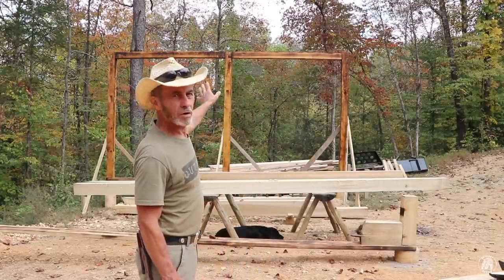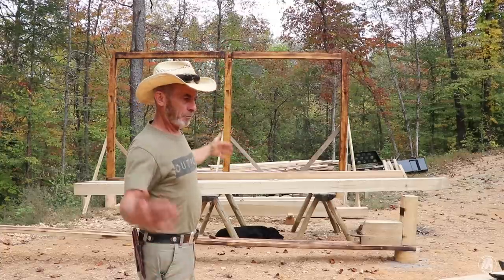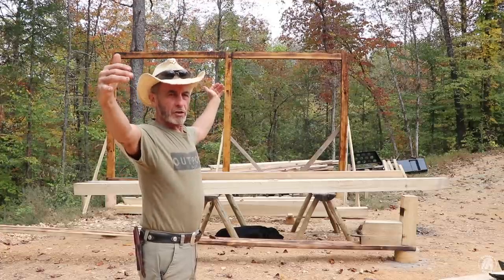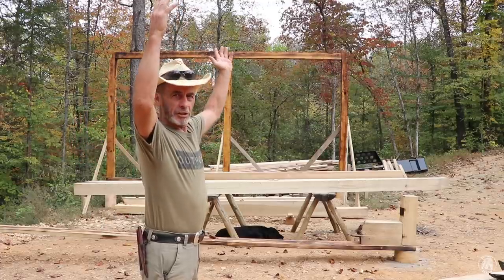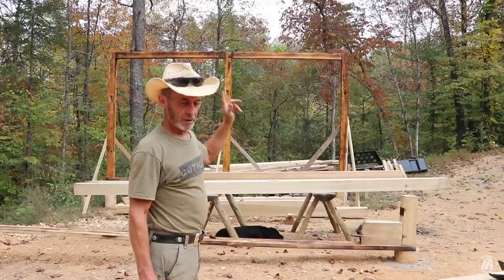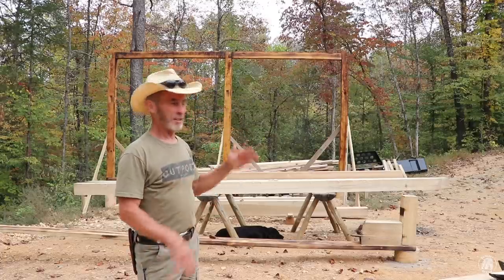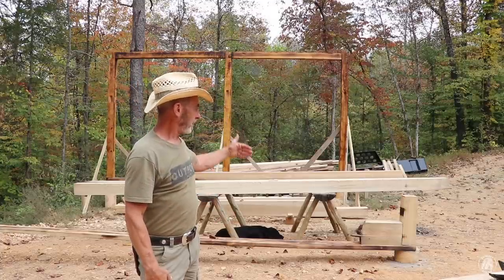That wall over there is the far end of the new building, and this wall right here will be the outside wall of the tallest portion. Not only is this a shed roof, but the side that the sawmill is going to be in is also going to be a shed roof. There's a section in here that's 12 feet wide that's going to be two stories. That's why I needed 16-foot posts, and I'll have to mortise those out for the bottom plate and the next six by ten that will support the floor joists for the upper floor.